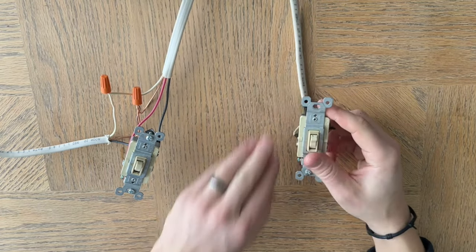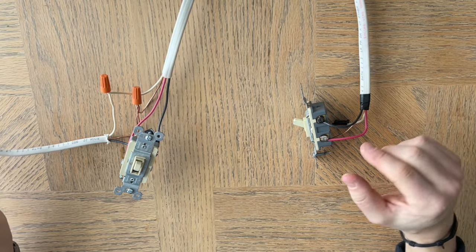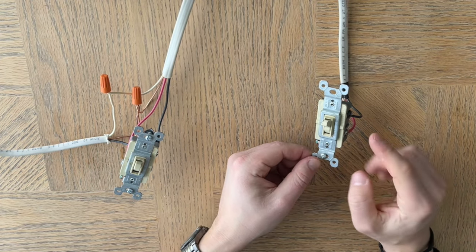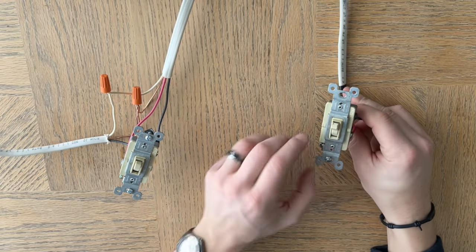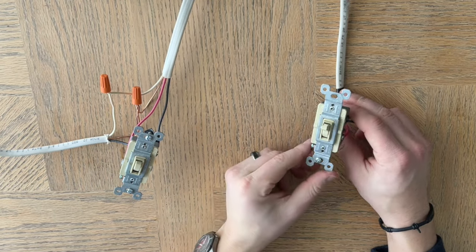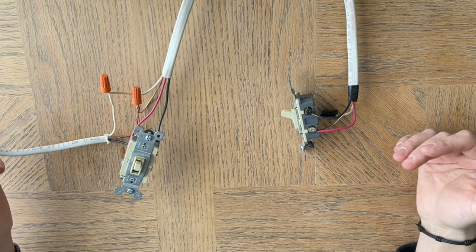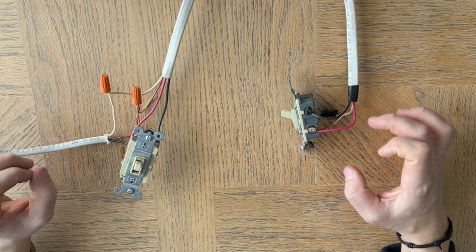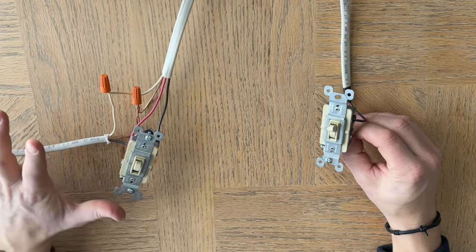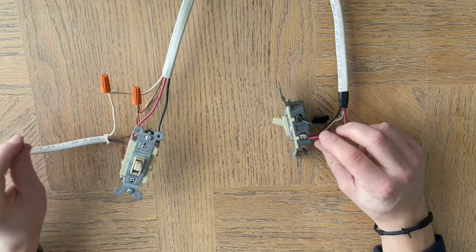If you have any questions, please comment below. These can be very difficult to navigate, especially if you are replacing existing switches. The main thing when replacing existing switches is to just copy it — find wherever the common is on the existing switch. Sometimes they wire them in upside down, which is a pain, but just flip it over mentally and figure it out. If you need any diagrams or help, you can find them online. I know when I was learning electrical this was the number one problem any time I encountered a three-way switch because it never seemed to work out.